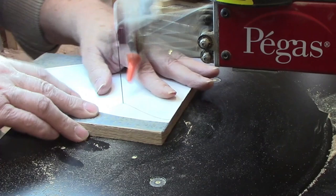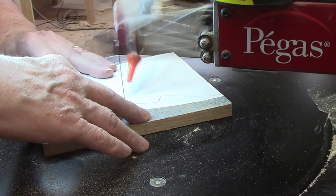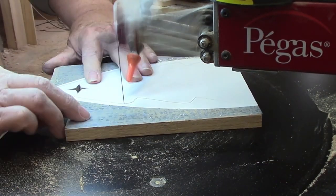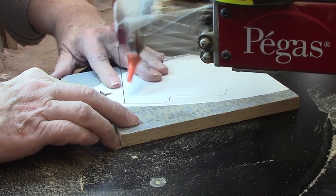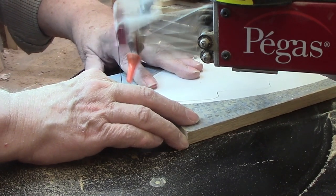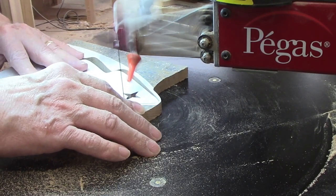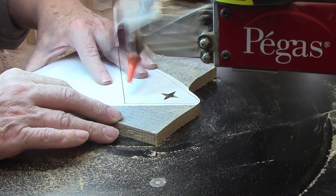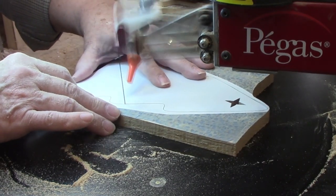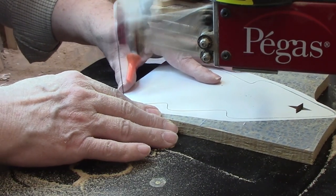This project has four layers, each of which is glued to another layer or layers. The outside outline is the same for all four layers and they all need to be congruent. All the layers need to be cut accurately or else the outside edge won't be a smooth tree-shaped curve. The shape can be sanded into conformity after the glue-up but it's much better to have as close a fit as possible. These patterns were produced on an inkjet printer and all the cut lines are therefore thin. I plan to cut right on the lines, which ensures minimal differences between the layers.